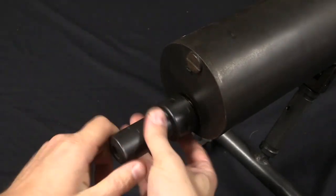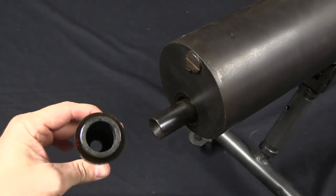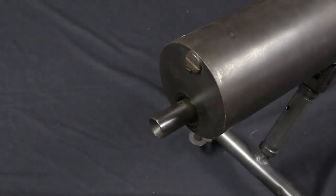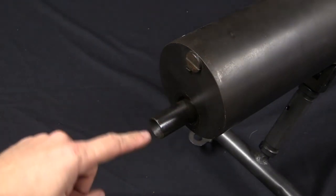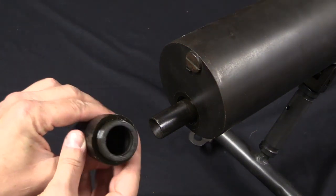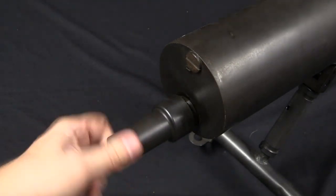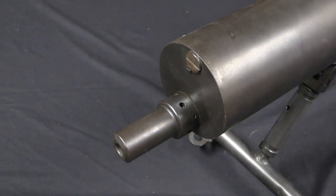One other accommodation made for use in vehicles was a change in the muzzle booster. Normally on a Vickers gun there is a flange threaded onto the front of the barrel that provides a cup-like surface, because this recoil booster is an essential element in making the gun run — it creates back pressure that pushes the barrel backwards. To change the barrel on a standard Vickers gun you have to take the booster off, then take the flange off the front, and then pull the barrel out the back. You don't want to have to get out of your tank to do that. So they designed a different style of barrel booster — they enlarged the front of the barrel and cut a conical surface inside the muzzle, which gives it the same effect and fits into this booster. This area generates enough back pressure to properly cycle the gun, and it means you can leave the booster on the gun and still pull the barrel out the back, because there's nothing oversized on the front. So if you had to change the barrel for any reason, you could do so from within the safety of the tank.